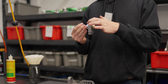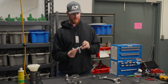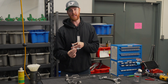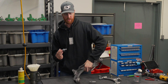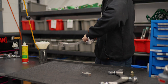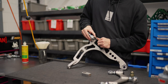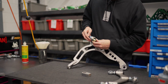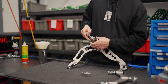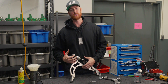When you take an impact, this is connected to the car and this is connected to the control arm. You zap this smooth adjuster off with an impact very quickly — much faster than I'm able to spin it off by hand. This comes off with your impact and you can simply remove the control arm. This is left on the car in the position you originally had it. When you go to put a new control arm on — say we damaged this one — you slap it in there. Because of the gap that's in here without the smooth adjuster, it makes aligning the heim joints really easy. Even if the heim joints were crooked on an angle, when you go to put the arm back on, you can almost get it started anyway, and as you tighten it on both points it'll automatically align itself. By the time you get to the end, you'll be perfectly aligned on both holes and have swapped the control arm within a matter of seconds.